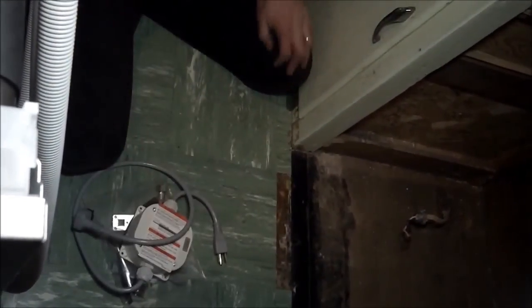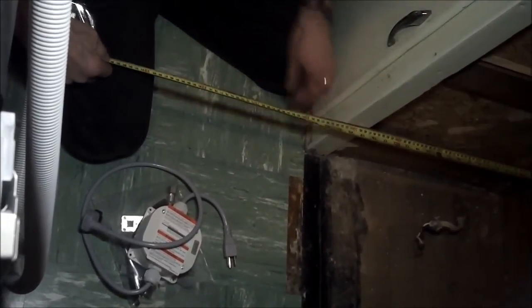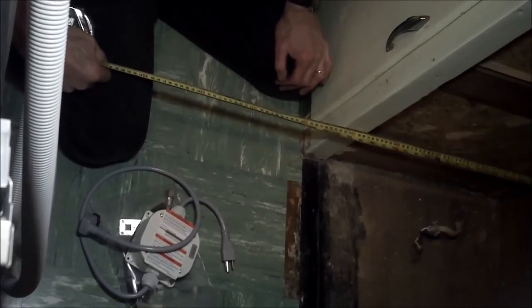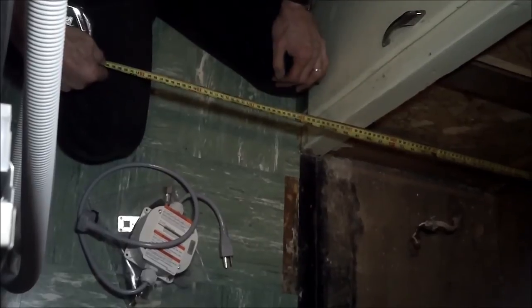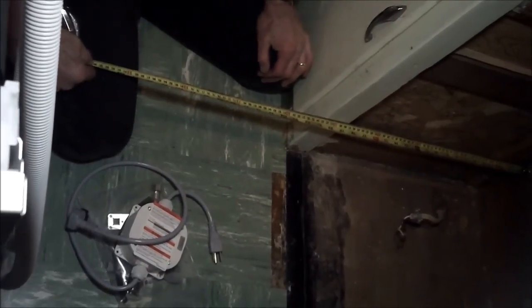We've got our Romex here, standard Romex, so I could put that in there, but I don't think I have room for it, because here's an interesting thing I just found out. The actual dimension from the front of the door to the back of the machine is 20 and a quarter, and as you can see, I'm at 20 and a quarter to my mop board, so in order to get this thing in here, I'm going to have to run